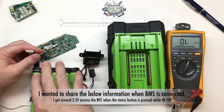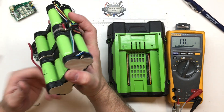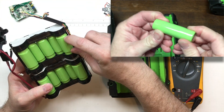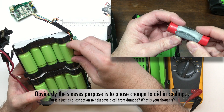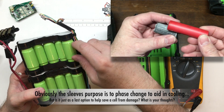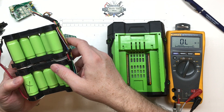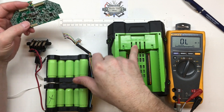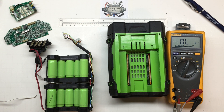I wanted to do a quick video on the terminals and what to check if you're having some kind of battery temperature issue and you don't think your pack is typically overheating. It's probably worth mentioning that in another video I showed where some of these sleeves had melted — you can tell because they didn't have sharp corners on the heat shrink, and the phase-changing material here for the cooling sleeves gets kind of rounded or flattened, meaning they actually melted and changed phase. The battery probably heated up quite a bit in that case. I hope this video was helpful for figuring out the T terminal. For the D terminal, stay tuned for the next video. If you like this video, please like, share, and subscribe — thanks for watching.